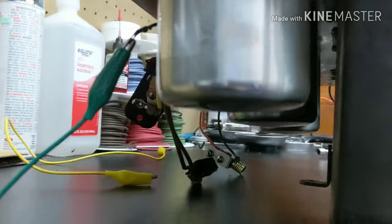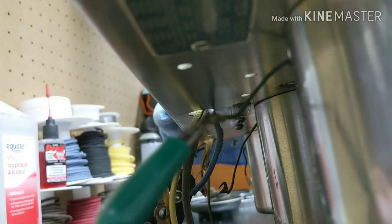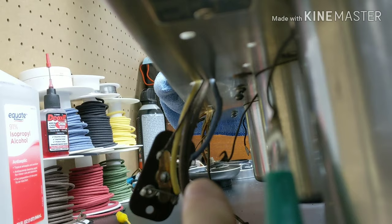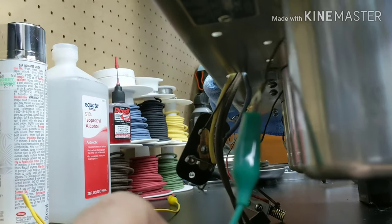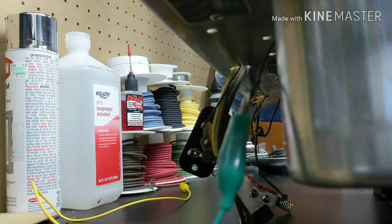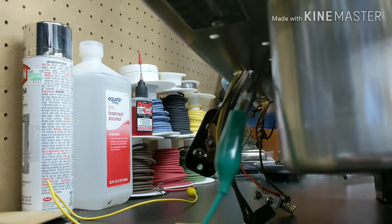Okay, so what I'm going to show you — those are the IF cans covering the transformer, and this is the wire I was telling you that I'm going to catch on each one of these. Each of the cans has the wire that goes to the tuning condenser — you can see them on down the line. So I'm on the first RF wire there on that can. Each time I come back to do one, I will have already connected my jumper wire up underneath there.